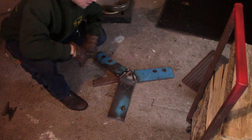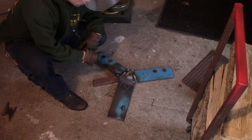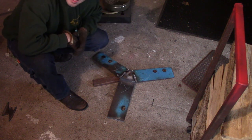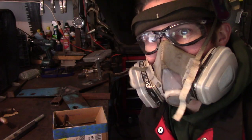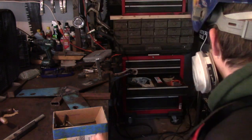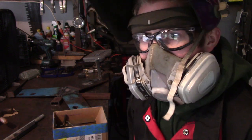As you can see, what the bend did is it allowed me to raise this up so that we only have three points of contact, meaning this thing will always be stable. I think this is going to be a perfect task for the arc welder. I ran a couple of practice beads, tacked it up, and I think we're going to be pretty good. I'll be welding 7014 rods at 120 amps DC positive electrode on my Hobart Stickmate LX-235. Let's give this a shot.